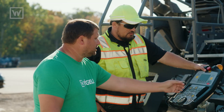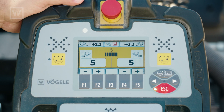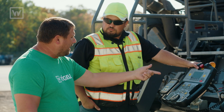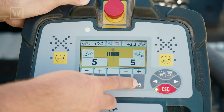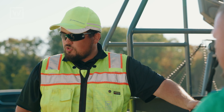Tyler, tell them about the sensitivity. We have sensitivity that you can control. You can go in and increase your sensitivity to nine, which will make the sensor react quicker, or you can lower it down to zero, which will slow it down. Five is the standard setting. So if you've got a tow point cylinder that's going up and down and it's hunting, take it down a notch. And if it's not making a grade control adjustment on time, you go up one notch. Any questions on that so far, Donny? No, that sounds great. Is there anything else I need to know?